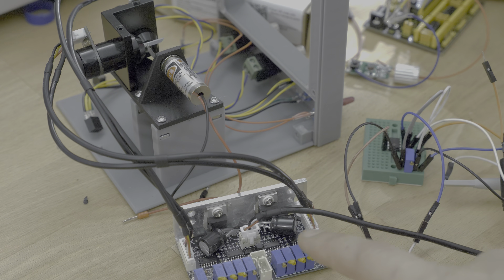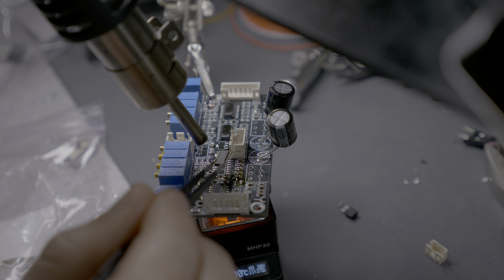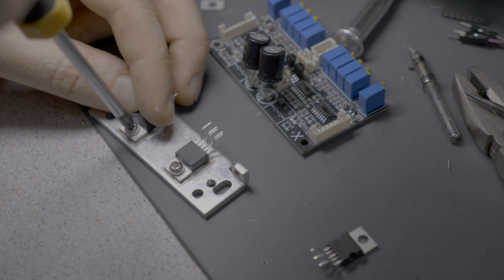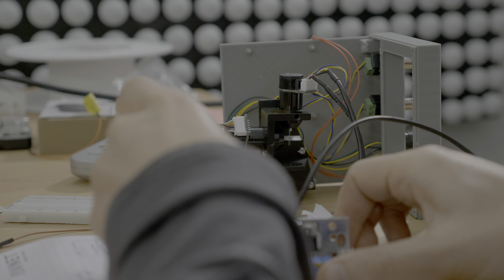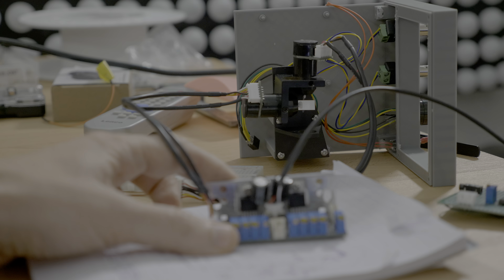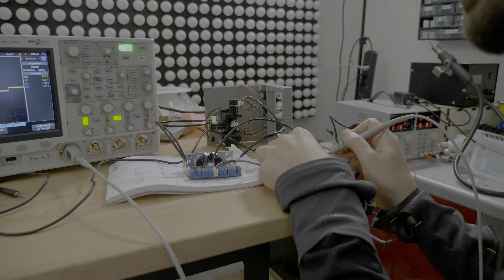But my hopes were crushed — the right side might be damaged. There was no way around replacing the shift registers or the drivers, so I ordered more parts and replaced the op-amps, the drivers, and the second 9 volt regulator. After checking voltages — 34, 33 — it looks all right. But still no success. This project was cursed and all my efforts trying to fix my screw-up failed.